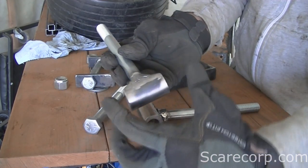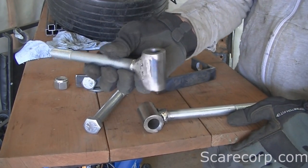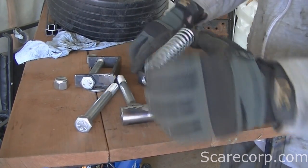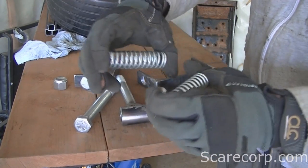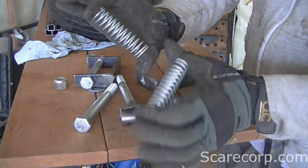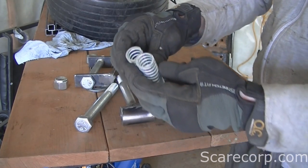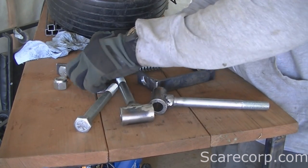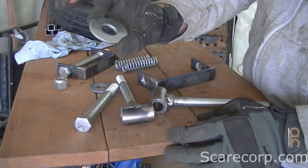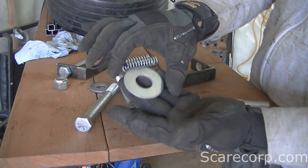They're about two inches long and about a quarter inch thick. This is a little bit thicker than I wanted, but that's what was available. I have two of those. Then I have these springs — not sure exactly what they're off of, but you can get them at any tractor supply store, in thicker and smaller sizes. The inside diameter is five-eighths. I also have a bunch of washers that are also inner diameter five-eighths, about two inches or so wide — a little bit too wide, but I'll see if I can make that work.